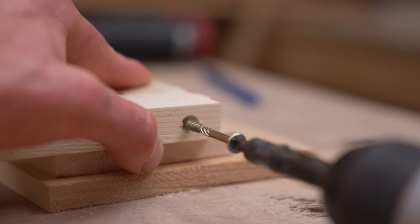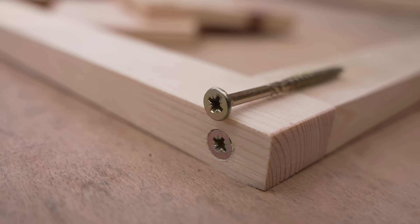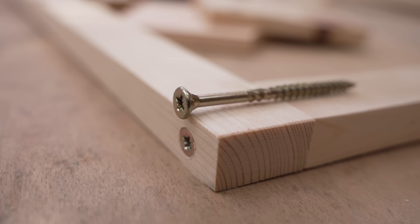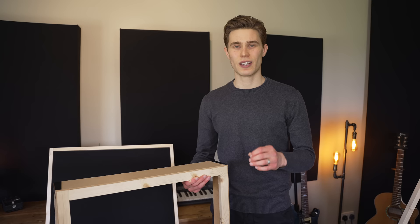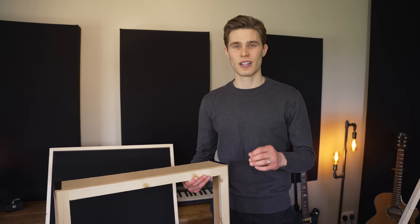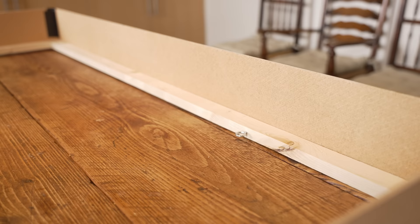I assembled the corners with simple 90 degree joints. I pre-drilled which helps avoid your screws splitting the wood, and if possible use a countersink to make sure that when you drill those screws in everything lays up really nice and flush to the surface. You should only need to use one screw per corner — if you're using more than that I'd probably look for a higher quality screw that really bites into the wood better. The final part of building the frame is to attach picture hanging hooks about one foot down from the top of the panel, the same distance on both sides. I attach these now because it's much more difficult to attach them later.